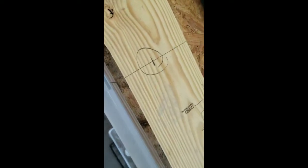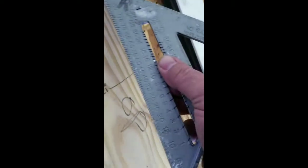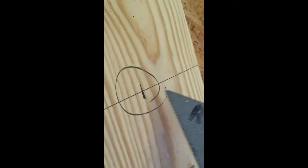The first board we're going to do — we're going to measure right flush from the end. We're going to come over and measure: if you want two inches of concrete, you measure the distance from the top to the center of the hole, right there, and then you mark it up here. Make sure you mark your top when you come to do that for every hole.